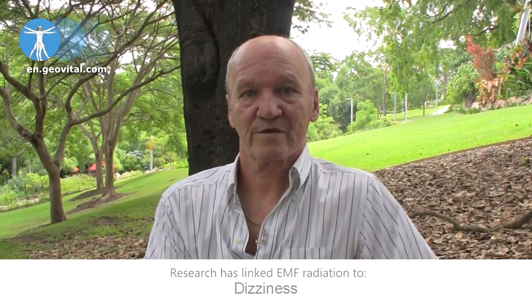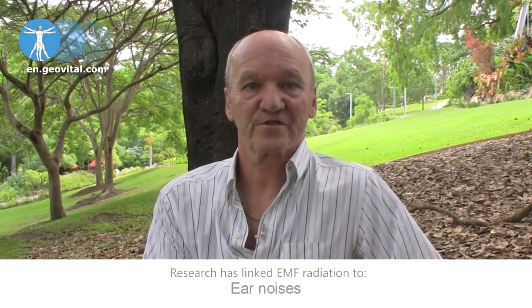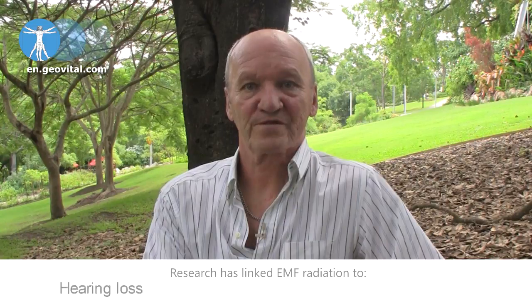Once identified, we know how many switches are needed and on which circuits, and an electrician can then install them. The circuit cutoff switch monitors the flow of electricity into a circuit. As soon as no power is being used — which at night is easily achievable — turning off the last bedside light causes the switch to effectively cut the power to the circuit, and the associated electrical fields and other radiation from the wiring is eliminated.